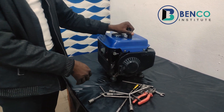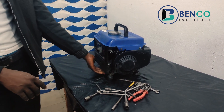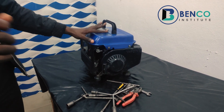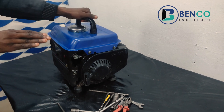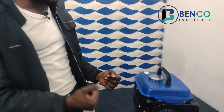We just put on the generator and it came on because before putting it on the table I had to drain out the fuel. But if you notice carefully, you would observe that the generator sound floats — it doesn't have smooth running. The generator sound is not smooth, and what this means is after some time it looks like the generator is gasping for breath, struggling to get fuel to work, and after some time the generator can go off or float even further.